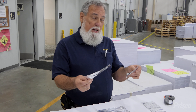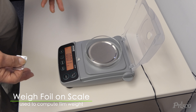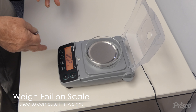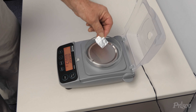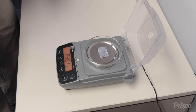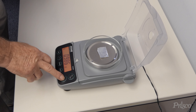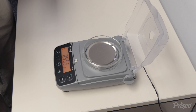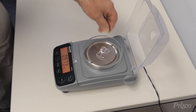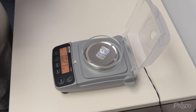We now have one 4x6 inch piece of foil that is coated and one that is not coated. We're going to weigh these two and see what the difference is. This is a very sensitive gram scale that will actually measure to 0.001 grams. First, we're going to weigh the piece of foil that has not been coated. Once that stabilizes, we'll zero it out — that becomes our tare weight. We remove that, then weigh the piece of foil that has been coated, and the difference in weight will give us the information we need.